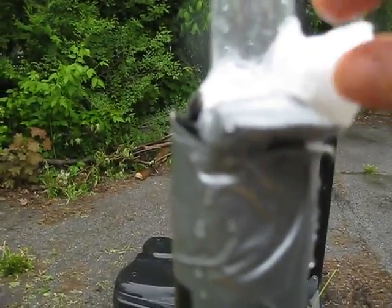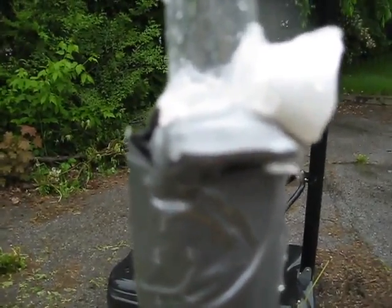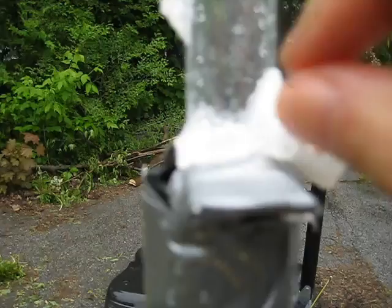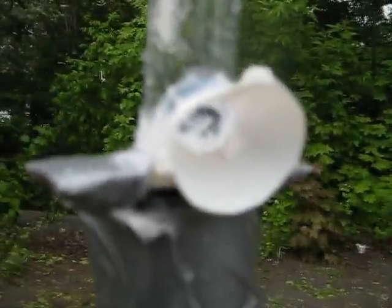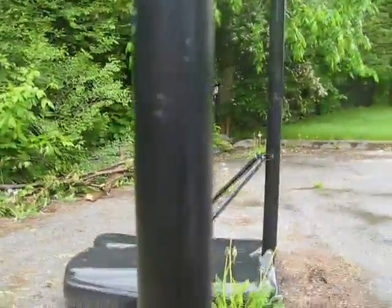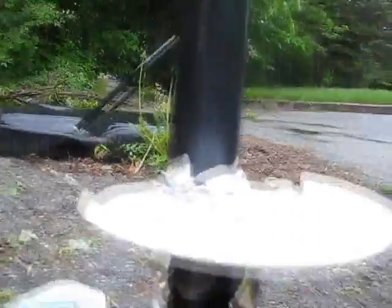But I don't want too much. The height of the water controls the amount of flow. If I have too much water in here — too much pressure — I get a stream. If I have too little, then nothing gets through the hole because of the surface tension. So that's why I have this spillover here to control the height of the water very precisely. The purpose of the tube is simply to prevent wind from redirecting the drops.